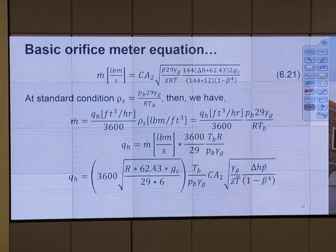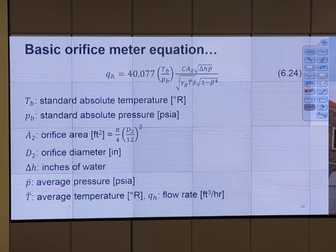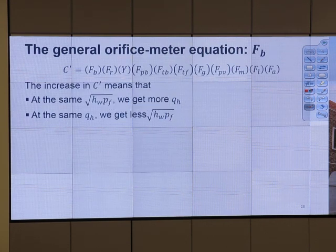But if you use an orifice plate, does it have to be certified? No. How much does the orifice plate cost? $30, and the pressure drop measurement, I have pressure measurement in the lab downstairs, like $1,000. Just that. Pressure drop measurement used to be a chart, which would be even cheaper. Now the electronic readout is what runs up the cost, and then the ability to read it. So one meter run will cost about a couple thousand dollars.